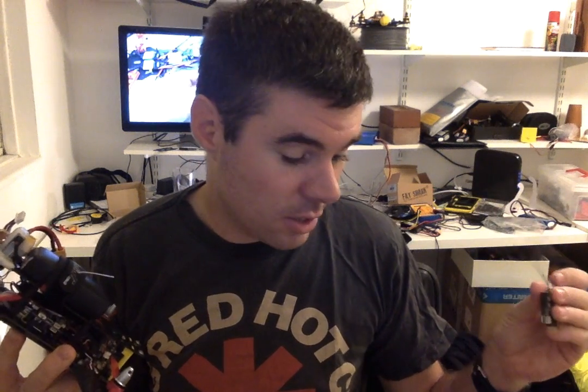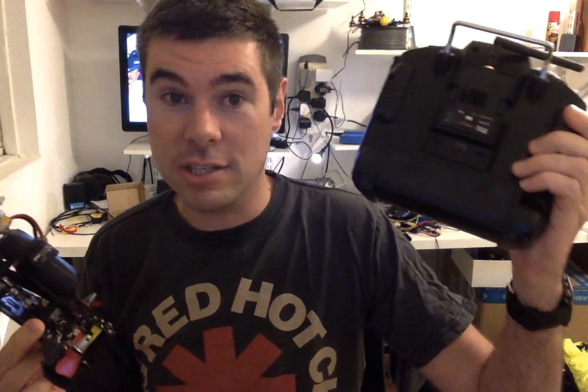Had a bit of a problem with the X4R. My Taranis is from before the European regulations forced FrSky to change the protocol a little bit, so it's not the EU version. These obviously came, they're the EU version. So I had to go through the process of loading the ER9X firmware on here, which has got a maintenance mode that you can use the pins in the back of your Taranis to then flash non-Euro mode onto this. I didn't actually do that in the end. I updated the XJT module I've got in the back to the European protocol, so now it works.